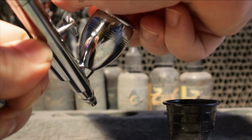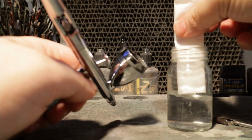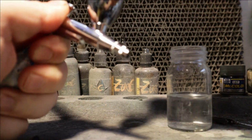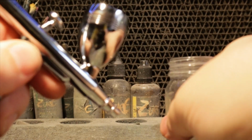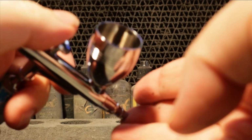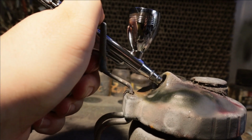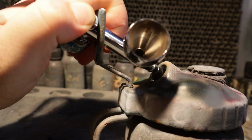For cleaning after use or changing colours, first we're reclaiming the paint, followed by wiping out the cup with toilet paper soaked in thinner. Again, I like the larger reservoir cups even if using a small amount of paint, as I can fit my finger in it comfortably. Lastly, filling with a strong solvent or gun cleaner, I plug up the end and pull the trigger back with the air down to create the jet bubble effect, which mixes all remnant paint with the thinner and flushes it all the way through via spraying it out.